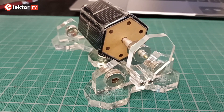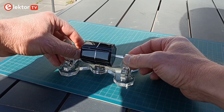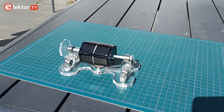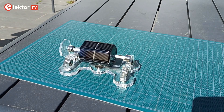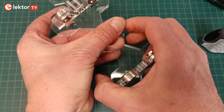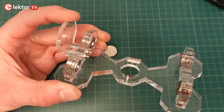When everything is in place, the motor is ready to spin. This works best in bright sunlight, but with a strong lamp it should be possible too. The light source should not be straight above the motor, but at an angle. Chances are that you must kickstart the rotor by carefully giving it a spin manually. If all is well, the motor continues spinning. The rotor will probably wobble depending on how well you balanced it — if it wobbles a lot, it may jump out of the bearings after a while, so be careful. When you are satisfied with the way the rotor levitates and spins, you can glue the magnets and the barrel to the shaft so they will stay in place. Also glue the bearing assemblies to the base plate. Note that many glues can be dissolved with acetone — the acrylic support appears to be insensitive to acetone, so you can correct gluing mistakes up to some level.